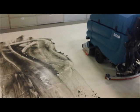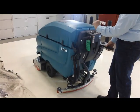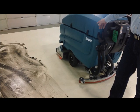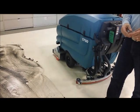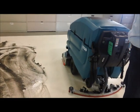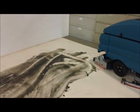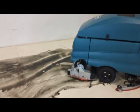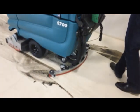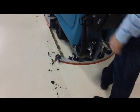I'm going to lower this down — you're going to hear the vac motor turn on, and then when I start moving, we vary the speed with the grips: twisting forward moves the machine forward, twisting back moves it backwards. This happens to be the 32-inch version of this scrubber sweeper, and it allows it to clean about 25,000 square feet per hour realistically. Not only is it scrubbing and sweeping, but it's vacuuming the floor completely dry, so we can have foot traffic on this machine almost immediately after moving.